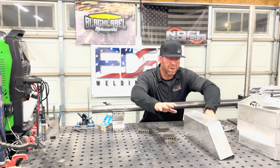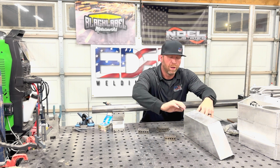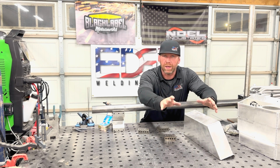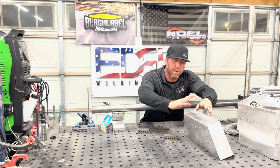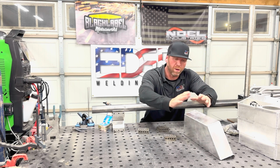Like I said, I do this to balance heat. By the time I've welded my last one, normally there are groups of 10 or 100 or whatever, the first one I did is cold. If you're not welding production, I get it. Not a lot of us do, and I don't do it all the time. But if I'm welding a part and it's crucial, which all of mine are because I have the same concept for everything, it's my brand. I want everything to look the same.